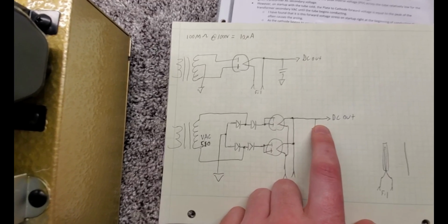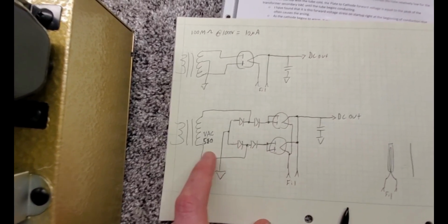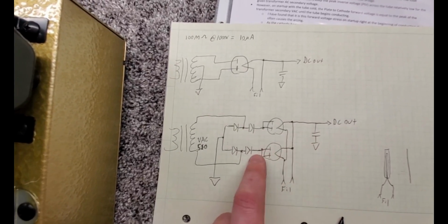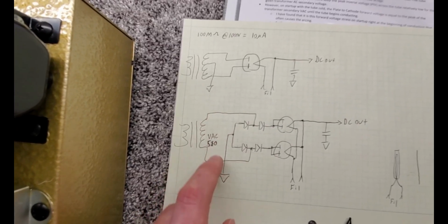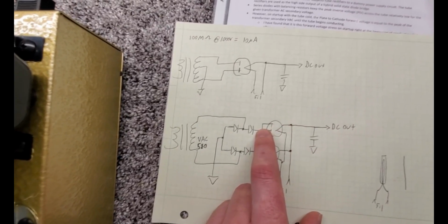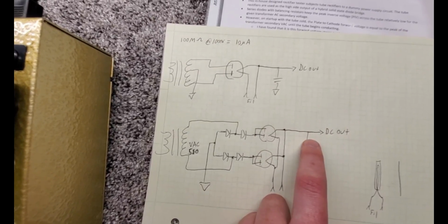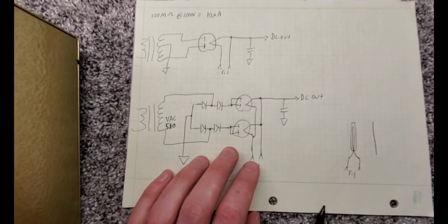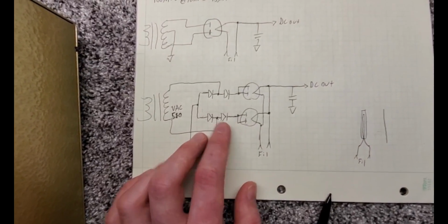So we're dividing the peak inverse voltage in this arrangement. Half of it goes across the tube that's non-conducting and half across the diode, simultaneously while this other path is delivering current to the load. They deliver current in alternating pulses relative to the phase of the winding. So if this phase is not delivering current and this phase is, it's reverse blocking the voltage that's maintained on this capacitor during the phase where it's off.